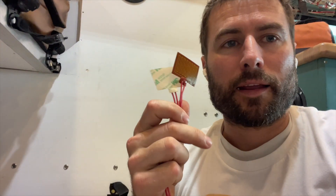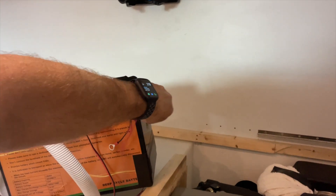To prevent those issues as well, I'm also adding these little heat pads to the bottom of this battery — four of them. Each one is a little 3-watt heater, giving a total of 12 watts of heat on the bottom. I'm going to set that up on a little 12-volt thermostat, set to turn on at 35 degrees Fahrenheit, which will start warming up the battery so it doesn't fall below freezing.